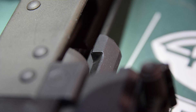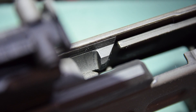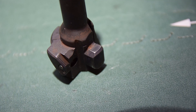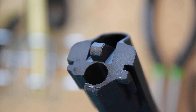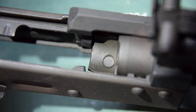Hopefully they will be here later in the week so we can go out and do some blasting on this rifle. We've already established that the gun is made using S7 tool steel for its trunnions, which would presumably be milled out of S7. But there were definitely a few cast parts in the firearm. I'm not entirely sure about the bolt — if it is cast, they did a really good job cleaning it up, because I don't see any casting lines on it. But I did find a casting mark on the carrier near the rear.